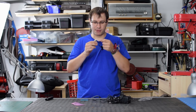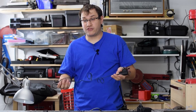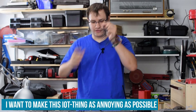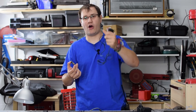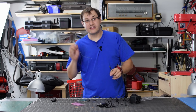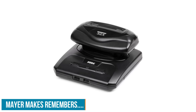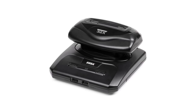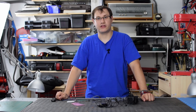This is pretty convenient because you can attach a LiPo battery directly to it to make your project portable. To power my project, I will use a 5V wall wart and not a single LiPo cell because convenience is something we don't need in this project. I will run it off this 5V wall wart, which would also just work if I applied 3.3V, but this way I can get away with more power consumption and some excess heat. And I will use an additional 12V power supply just to run some LEDs and make it even more cumbersome because you have to plug two things into a wall — just like that Sega Genesis 32X with the CD portion that needed three power plugs.